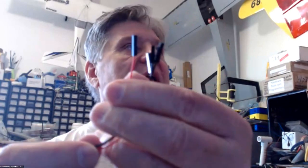Well, I think that's a learning opportunity also, in trying to figure out how to solve the problem of getting things done at some factory, whether it's in the United States or overseas. So I'm willing to work through that with you too. Yeah. Another part of the education is learning how to crimp these things together. You can buy the parts. You crimp the wires, cut the wire to length, crimp it on. And that's something little kids probably can do better than I can, because my fingers are really big and to hold the little tiny parts is tough.